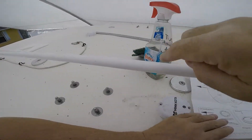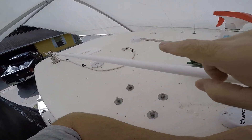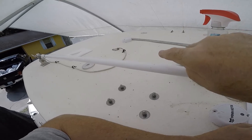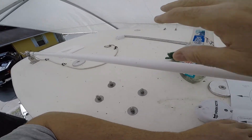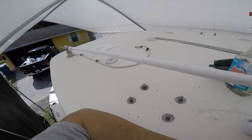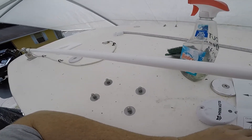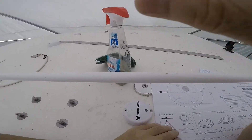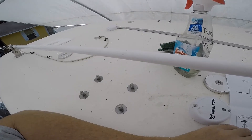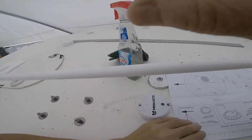When you install all of these things, they want them about two feet apart. The radar is going up in the bow and it might be a little close to one unit, so I might have to move that later. You don't want interference between these by sticking them all on top of one another. I saw a video where someone installed radar right over top of GPS devices, and when I commented they said they had no problems.